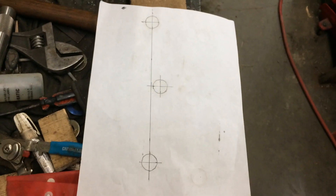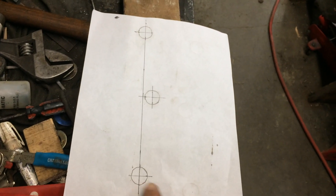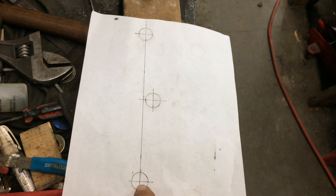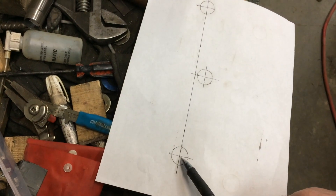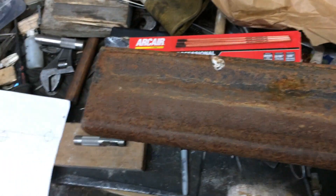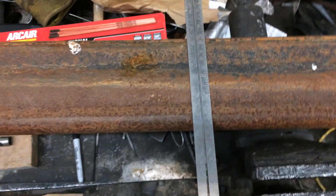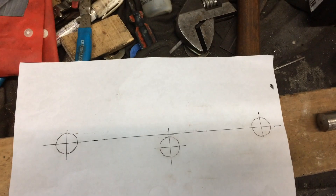After finding the traced marks, you lay out centers. What I'm going to do is punch a hole directly into each crosshair of the center marks — here, here, and here. And then I'm going to lay out this piece of steel and put it in center.